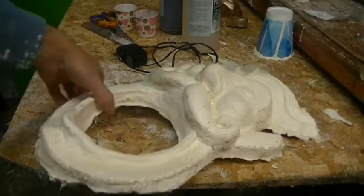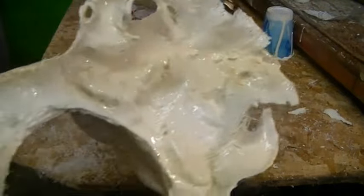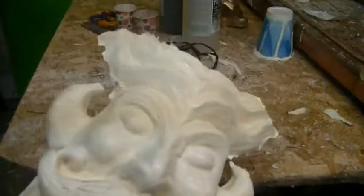What we have here is the casting — the sculpture. It's poured pretty thick, reinforced with fiberglass and stuff. I've got to clean up all these edges, so I'm going to get started doing that. What I'm using here is just a small wood rasp, but it works pretty good to clean up the edges — it gets all the polyurethane resin and the fiberglass off.